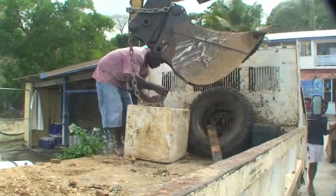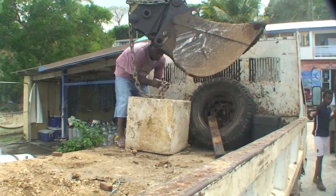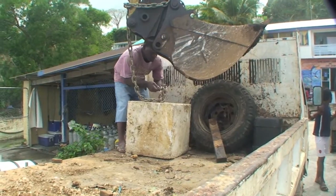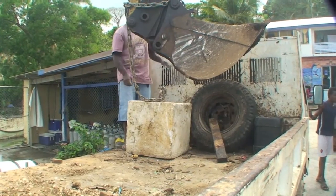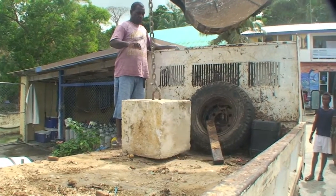These are our 400-kilo blocks — each block is 400 kilos. Because they're going to around 700 metres of water, they've been poured in a mould with a lot of reinforcement put in during the pouring. The blocks are actually left for more than 28 days to cure, because of the pressure at 700 metres depth.